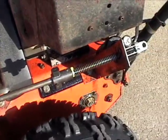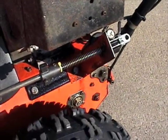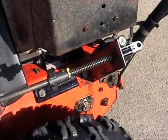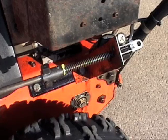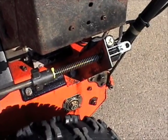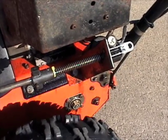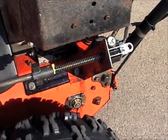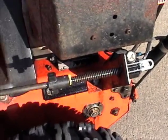It's really important if you decide to do this that when you pull the motor from the seat, you also take whatever type of piece of plastic — a lot of times it's a nylon block — that's on the threaded rod. It's really important that you get that too, because otherwise you have no way of connecting the screw to anything else.